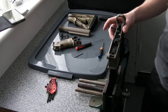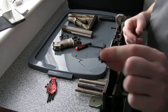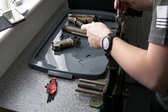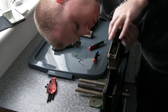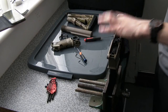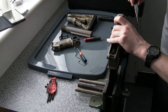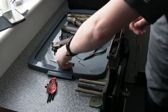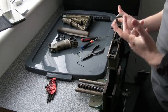They're definitely working because the gun won't go to safe while it's not cocked. Cock the hammer, safety goes on. All we've got now is our full auto sear — this is what's going to hold in our retaining plate that we saw earlier. At this point pretty much all the lower internals are retained — all the pins — by that plate, and then it's literally just this e-clip that's going to hold in the pin for the full auto sear. Then we'll move on to the slightly larger parts.